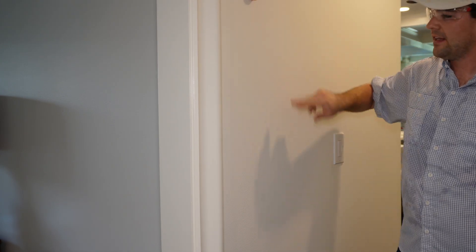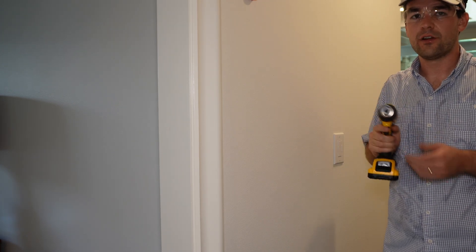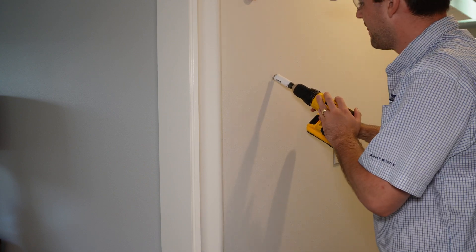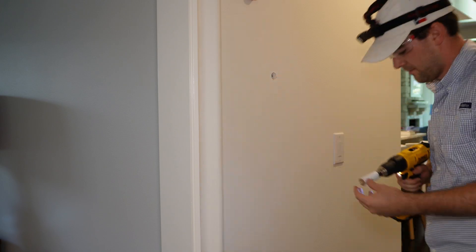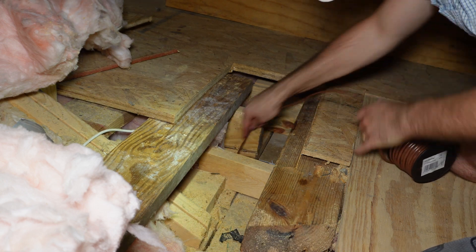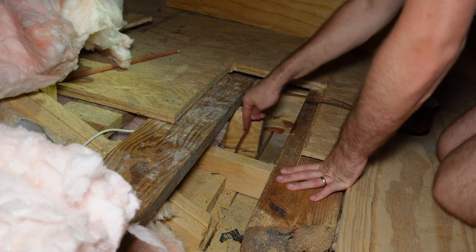So we know where our chime is. We're in this wall cavity and we have measured out our hole to where we're going to make a pilot hole to hold the cable for the thermostat wire and hold the Ecobee thermostat. You can see on the screen the hole that we made — there's light coming through and we're in the correct cavity, so we're going to continue with running the wire. We're going to take our thermostat wire and feed it through the hole and have a helper ready to grab it on the other side.